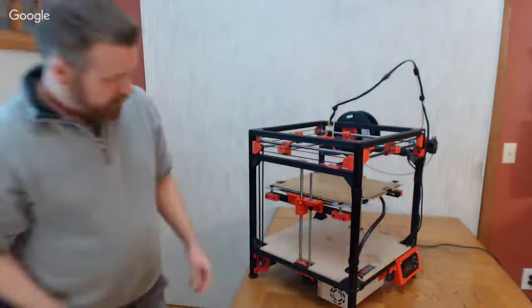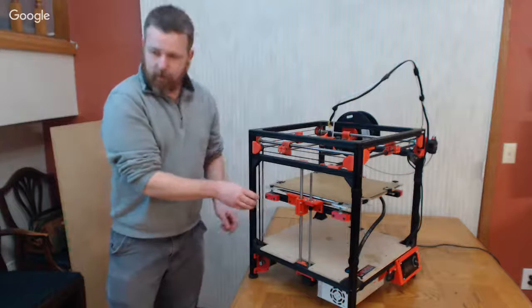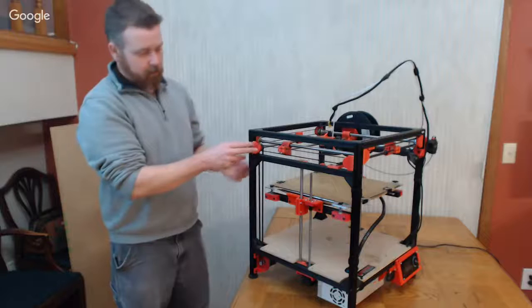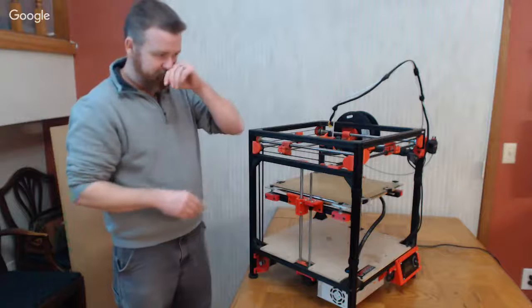Okay. I'd have to loosen up these bolts down here and then take tension off of the belt going up to here. You don't have your motors installed yet, and that's good. You want to get everything aligned before you start putting force on that motor or on the shaft with the motor and the belt and everything from it. You always want to have it kind of free moving right now.